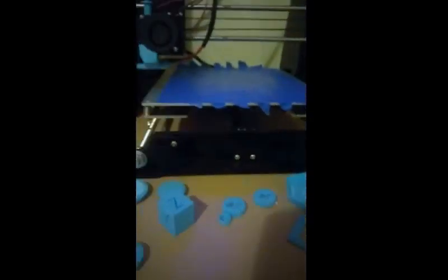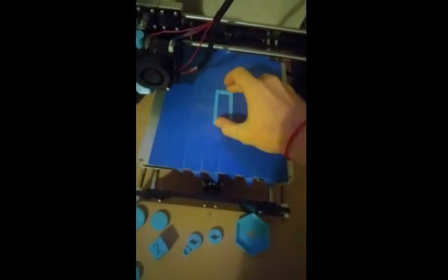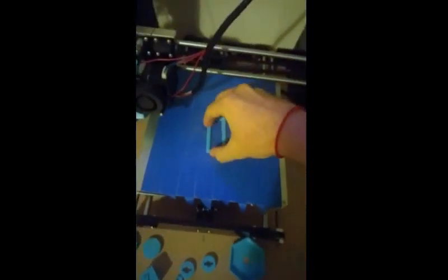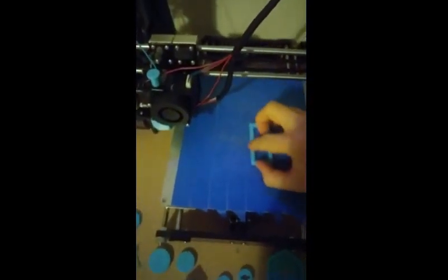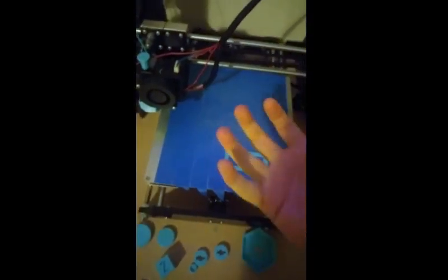So with my next video, I tried to print a hook, and halfway through the print, it comes off the board. Your nozzle's printing around it, and then all of a sudden it just unsticks in the middle of the print, and it moves with the nozzle. So your nozzle stays and it's trying to do the printing, but this big glob stays there, or it pushes it to the side, and then it just does all this squiggly, sort of hairball of plastic.